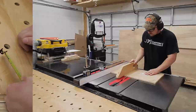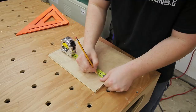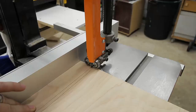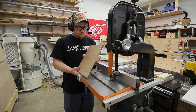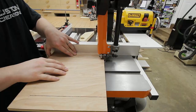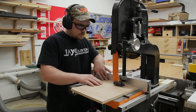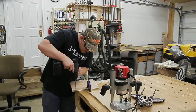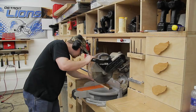First thing I'll do is cut the plywood to an appropriate length and then mark out all of the cuts needed for this jig. I'm cutting out the adjustment slots on the bandsaw, and to make sure both slots are identical, I'm making the first cut to both slots first without moving the fence — just flipping the board end for end — then moving the fence to the second position and repeating. To finish out the slot I'm using a slightly oversized drill bit to connect both bandsaw cuts and release the interior material. For the adjustable parallel guides I'm using a couple pieces of scrap oak.